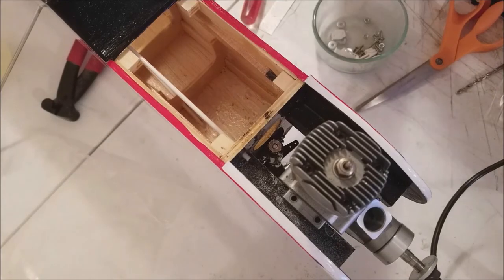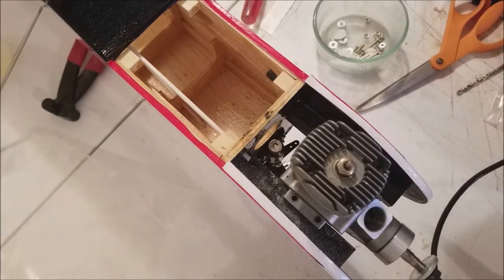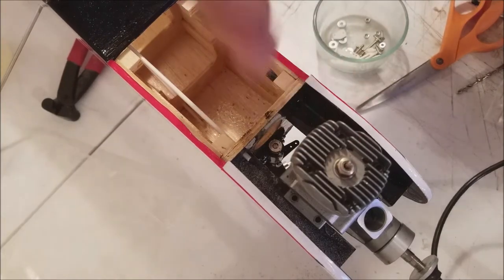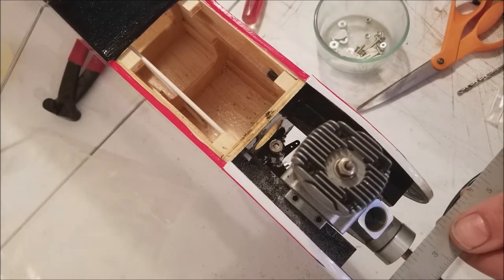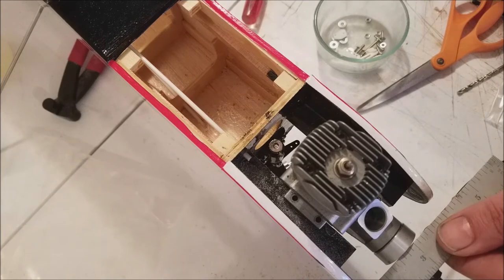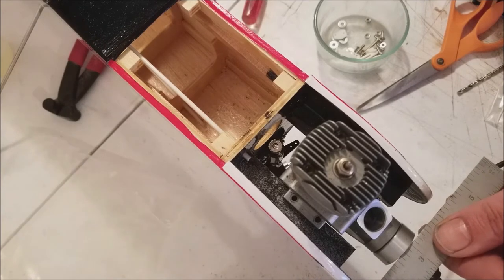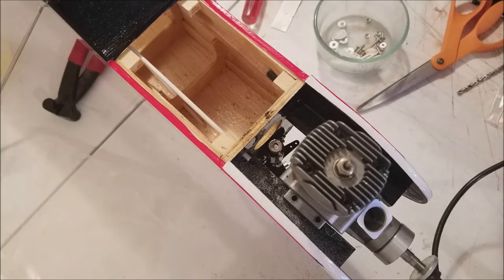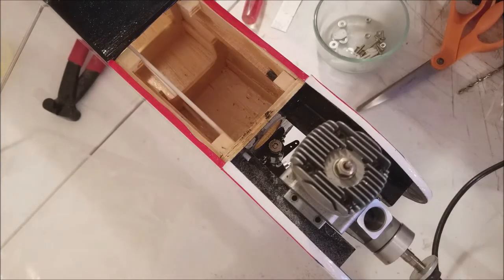Okay, here we are. I've got my motor rails trimmed out just a little bit, and it didn't take much. I just used a file. Now I reset the motor, making sure we're in the right spot, square to the airplane or parallel, and that our drive washer is actually going to clear the cheeks of the fuselage. So that is good. Now we've got to mark the holes for where we're going to drill our screw holes